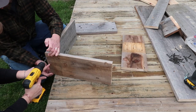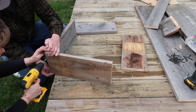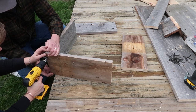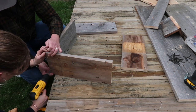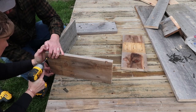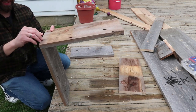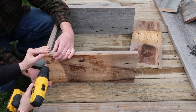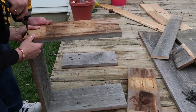After we cut the boards to size, we pre-drilled holes so we could countersink the screws, because on the corners we're going to be putting edge pieces, and we wanted them to lay flat when we screw those in. For these we just did two screws for each board. My husband helped me with some of this because the screws weren't going in as easy as I wanted. I also forgot to sand the inside when I was sanding the outside, so I'll be doing that later.